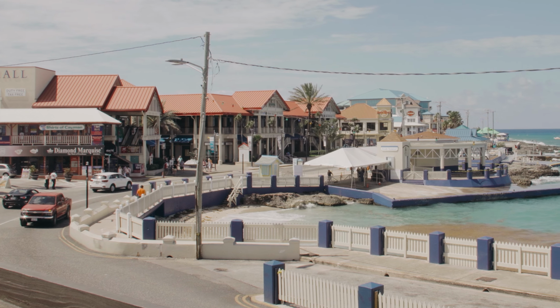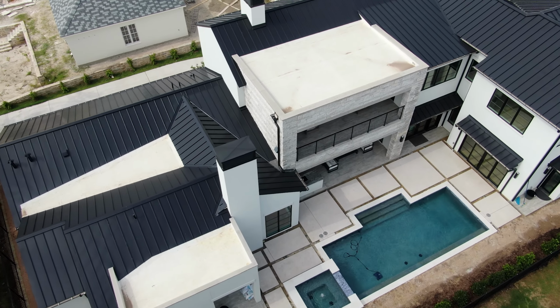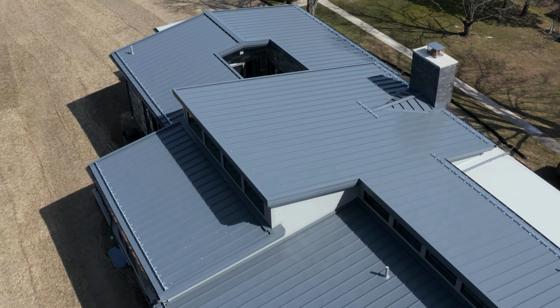Yeah, absolutely. And I think to take that a point further is, depending on the geographical location of a roof, right? Exposure to saltwater elements, coastal installations can accelerate the weathering of a roof. It can accelerate the amount of corrosion or rust you're going to have. Also, geographical locations that have a lot of sun exposure can be detrimental in the long term to the roof coating system just because of the UV attack coming from the sun. So in understanding when to make a replacement versus, if a repaint's still an option, it's a good time to consider how long the roof's been installed for, and then take a look at what level of extension of service life you want. Because, as we'll talk about later, there's a lot of different coating systems out there. There's sort of a good, better, best. And so you make the decision on how much time you want to add to the service of the roof itself.